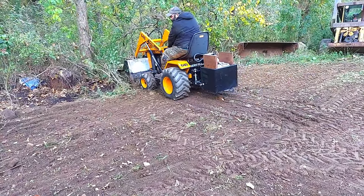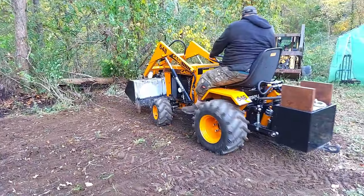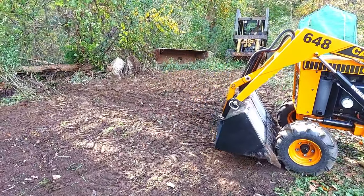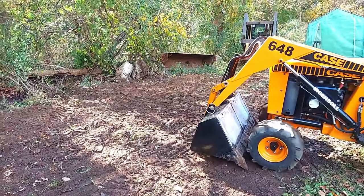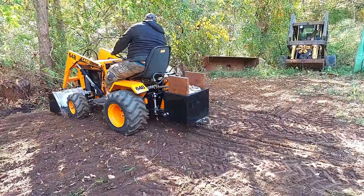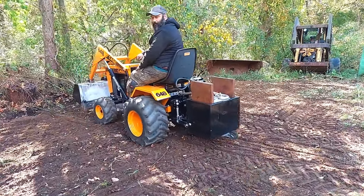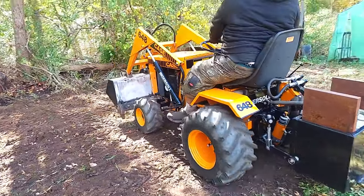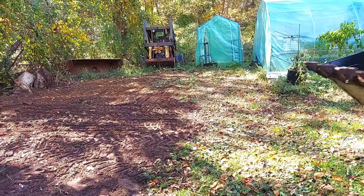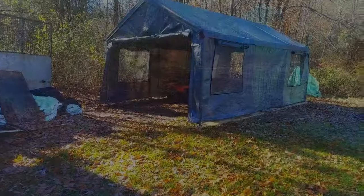You can curl the bucket right back almost under the tires and scrape the windrow of debris while leveling at the same time. To adjust the governor it's a little bit sensitive, especially with this bigger pump - it reacts almost a little too quick, so just got to move the spring to another hole probably. Sometimes it sounds like it's surging but it's not, it's just the engine and governor reacting really quick. Be sure to subscribe and go to our website for parts and tons of information on Case Ingersoll - CaseIngersolltractors.com.